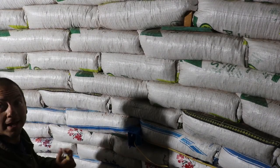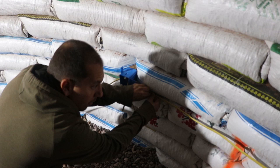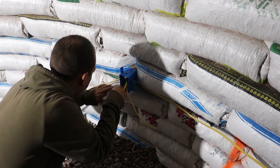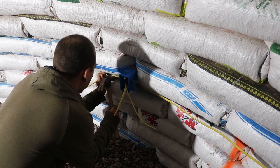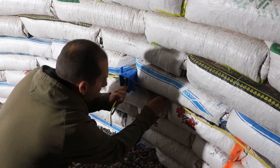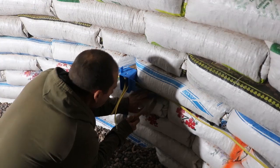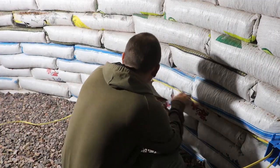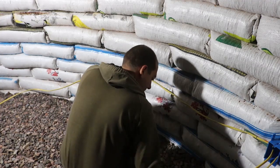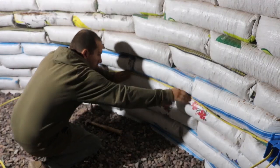4:30 in the morning, and I'm back up here stringing wire. Doing the wiring in an Earthbag house is quite a bit different than your standard conventional home wiring, because the walls are very different. Yeah, obviously it presented some challenges. I was going to use duct tape all around here, but finding those landscape pins really was a key to just holding this wire in place.